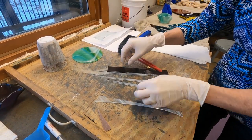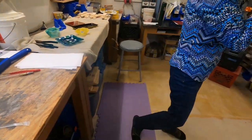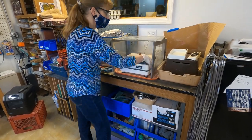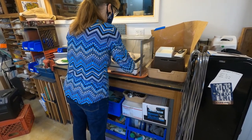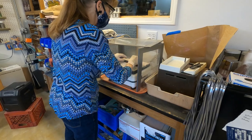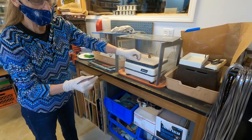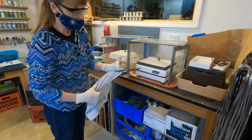What's next? I'm going to take my three pieces and my base and come over to the grinder. This is a water-cooled grinder with a diamond-tip head. There's a sponge in the back that wicks up water, and I basically just run the glass edge along it. It's literally tiny pieces of diamond on the head that grind the edge. I'll go through that process and then dry the piece off really well.